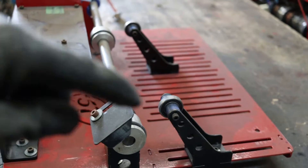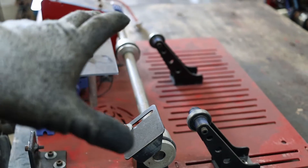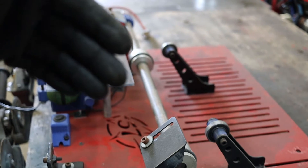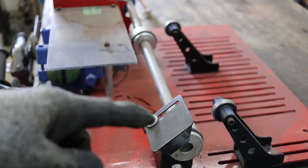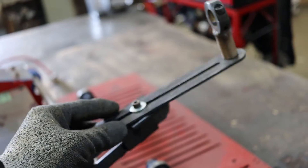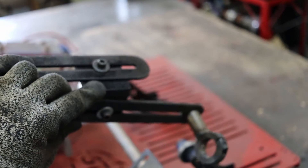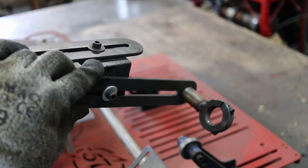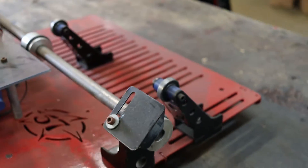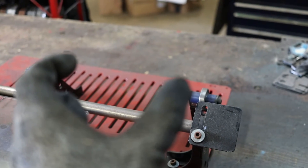The rollers are adjustable in length on the shaft and adjustable in dimension, so I can weld a big wheel. I made a jig so I can install the handle for the plasma cutter and position it to cut into a wheel, then roll a slice of steel welded back to the wheel — so I can make custom wheels with whatever offset I want.